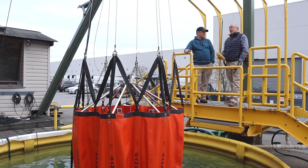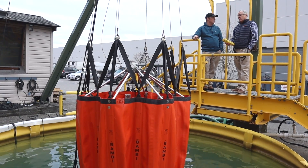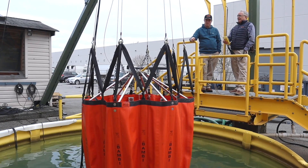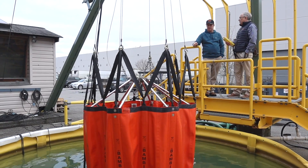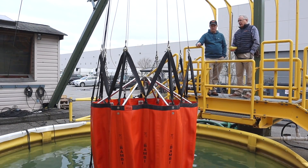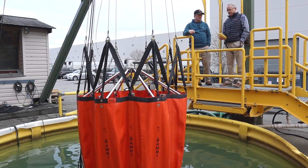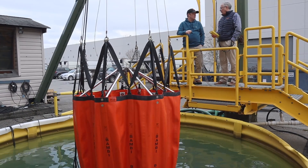These are electrically driven DC pumps. For smaller aircraft it's not a problem, but when you get to larger aircraft it becomes more of an issue because the primary power is all AC. Their DC side is as limited as you'd find in a 212 — they just don't have a lot of DC power. So they'll often have to put a power conversion in or look at trying to use AC pumps. SEI has never made an AC pump version in the past but they're actually prototyping one right now.